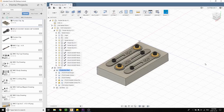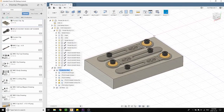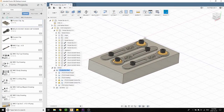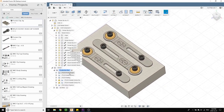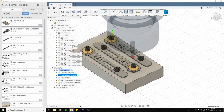This is a fixture I'm going to use to cut the pocket clips out. It's just a small block of aluminum that will fit on the small vise I have on the mill. We're going to use a tape and superglue trick to hold some 50 thou stainless steel raw stock on top of this little block, sized the same as the block. Then we're going to run a pocketing operation on the critical part of the pocket clips which registers the threaded portion of the cap and helps align them.